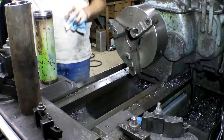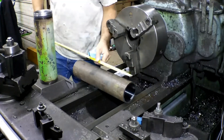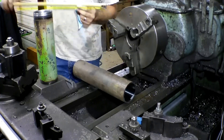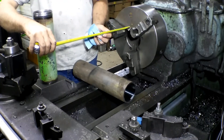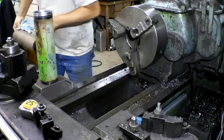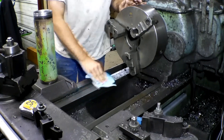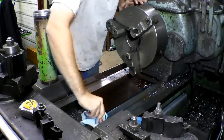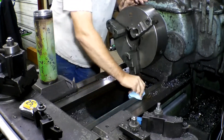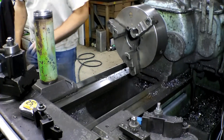The first thing we do is measure our piece of material — see how long it is and where we need the steady rest to be. I need my piece at 16 inches long, so I want to be about 12 inches in, which puts me right here. Then we take a rag and clean off the ways — nothing worse than having something under your steady rest, clamping it down, and damaging your ways. I'll wipe down my jaws a little bit too to keep everything clean.